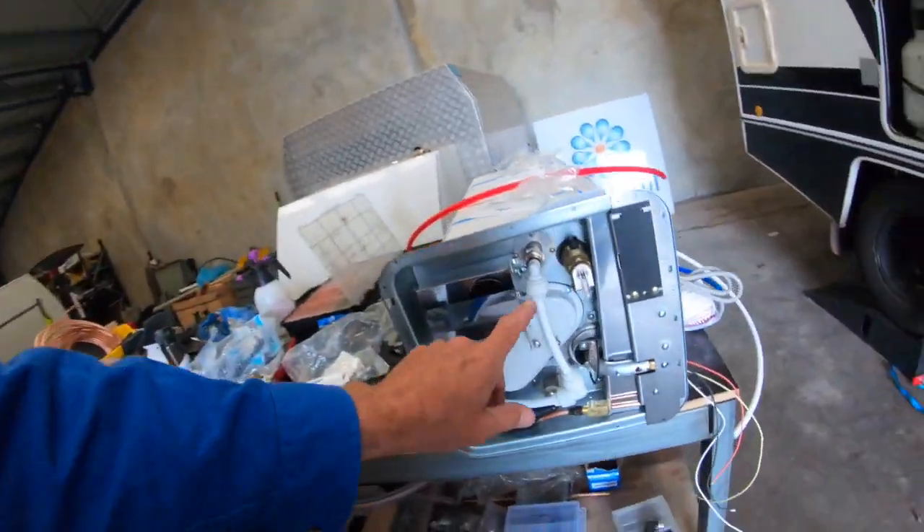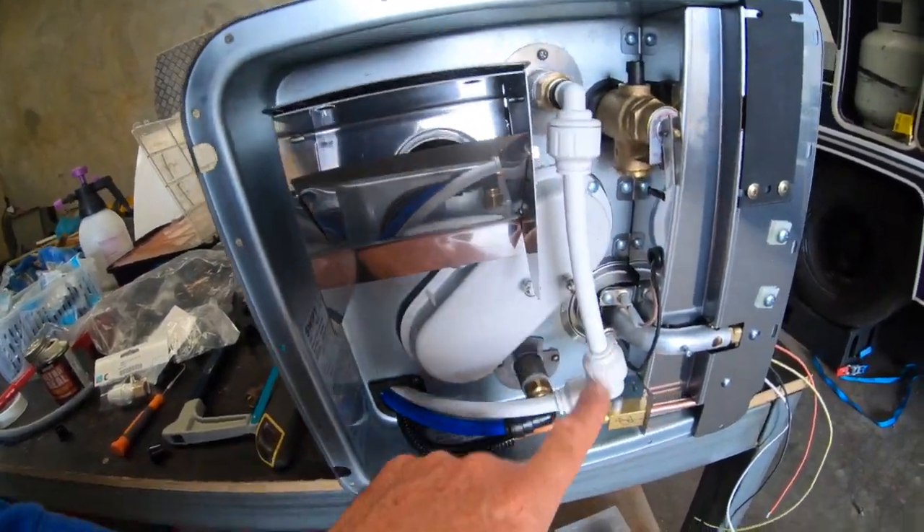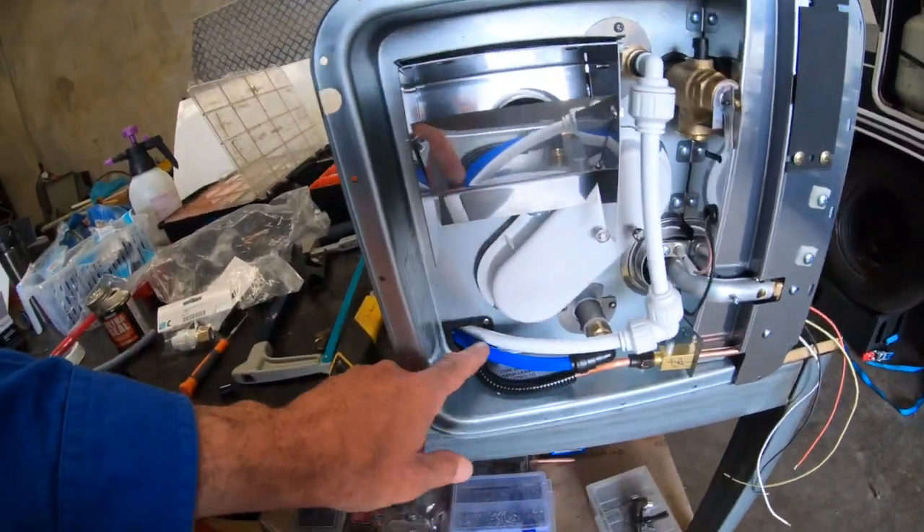You've still got the little sleeves that still got to go inside - they're a lot thicker and a different size. So that's where the water just can't come out. If you've got a storage hot water system, ask your plumber - make sure that they use the approved ones, the ones that look like this with John Guest fittings that are watermark approved. The 70-degree water will come out and go around and then it will go into the side of the temp valve. Cold line will come on the other side and then the 50-degree water will come out the bottom - I'll show you that inside, how we set that up.